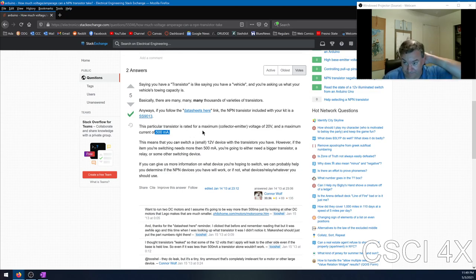Milliamps, right? So half an amp, whereas the relay holds 10 amps, right? Pretty significant difference. A relay can hold a lot more current, because remember, this thing's a giant magnet smashing over, and there's a big beefy bus essentially that you're touching. A lot of current can flow through it. Transistor, you'll blow it out if you try pushing 10 amps through a little BB transistor like that. So there's different needs for different circumstances.